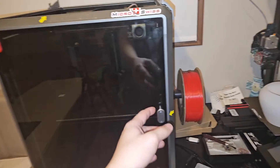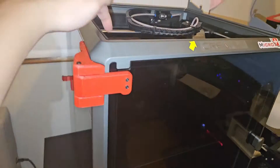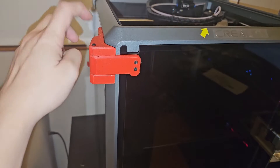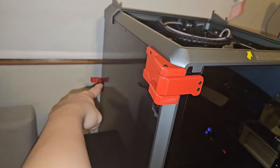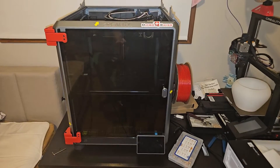We've done the 270-degree door hinge! Opening the door — keep opening — now it's stuck open. Amazing! I don't feel any contact with the belt or anything sensitive below. The installation tip: first install the brackets onto the glass, then mount everything onto the printer using the screws. Don't try to put it all together with the glass already on like I did. It took me two days and about an hour total. I hope this video helps you do it step by step. Everything is linked in the description — thanks for watching, keep on printing!